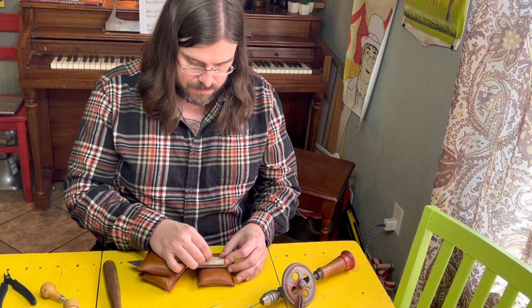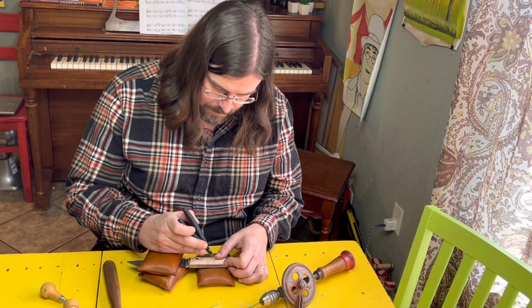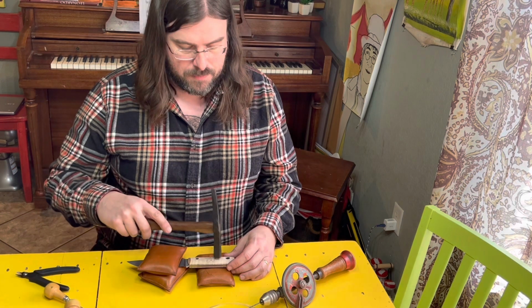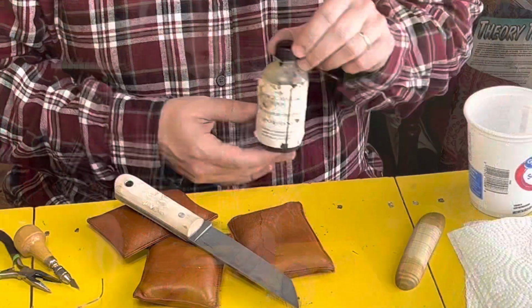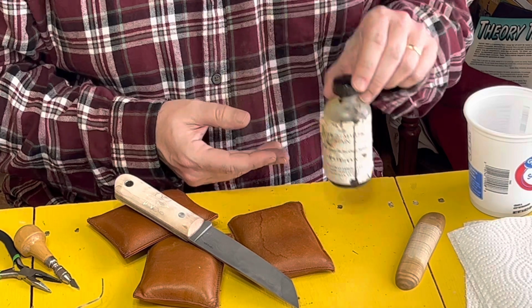After that, you're going to get it wet and then heat it up a little bit, and that will close the wood that you spread apart to get the wire in there, close it up and hold the wire. Then you're going to sand that down flat and make it nice so that you can do the dyeing. You have that inlay already sanded down.